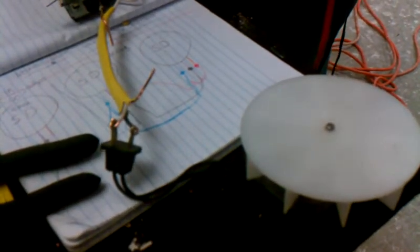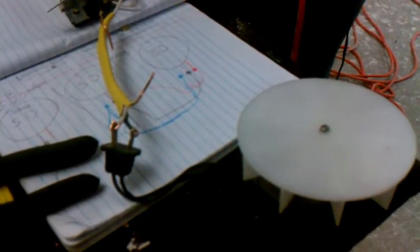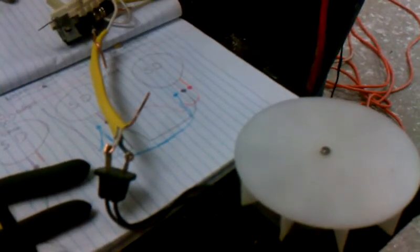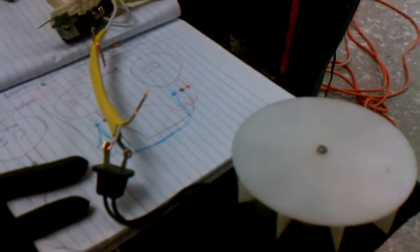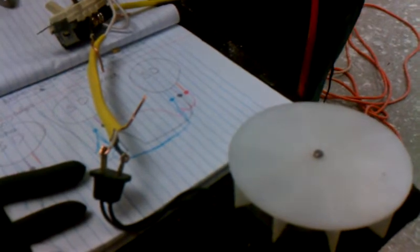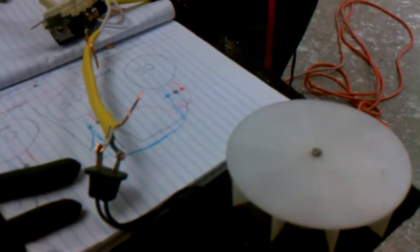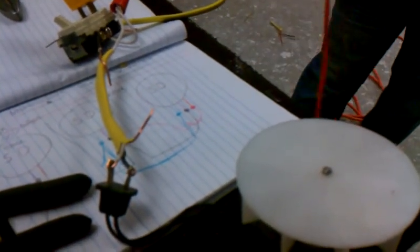But you see, I didn't use the ground screw in there. I used the housing, because the ground right here is connected to the entire housing, and that's what makes everything grounded in there. So when you pull this out of a box, and if you touch the box and get shocked, that means there is some hot wire open inside the box, touching the box. Right. Mm-hmm. Okay. Cool. All right, we about to wrap.